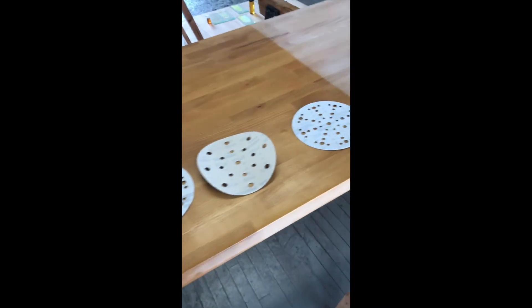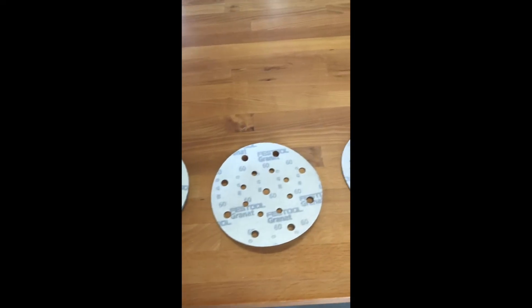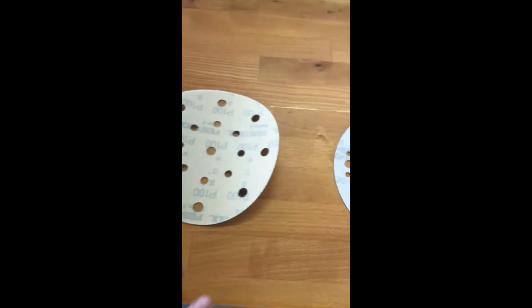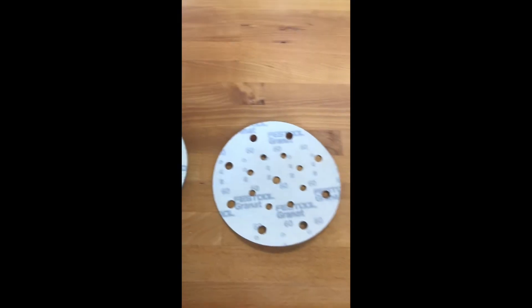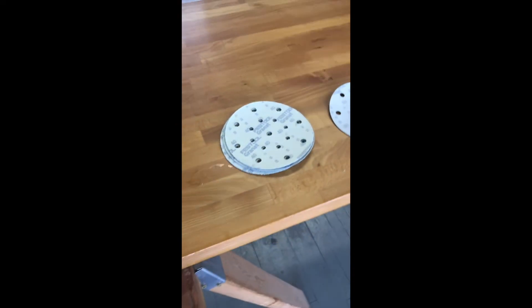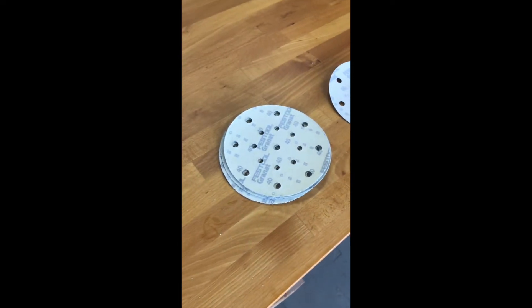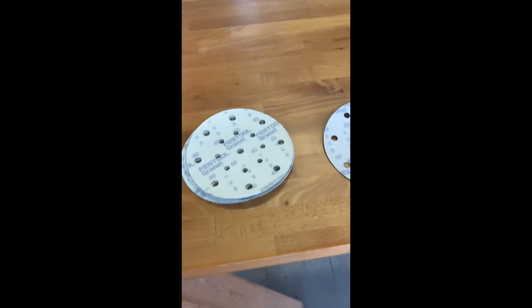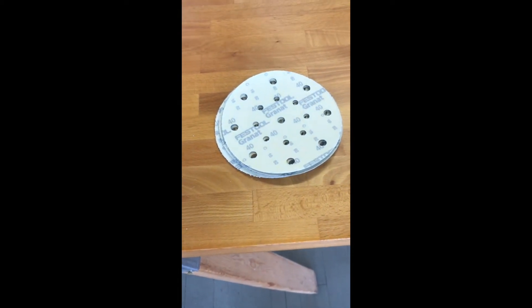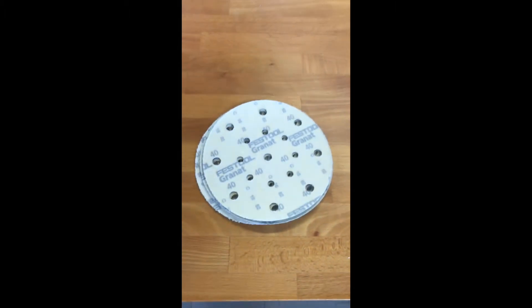The key to a good sanding is lots of different grits — successive grits of sandpaper — working your way from coarse to do the brunt of the work, and then basically polishing that up. Each step removes the scratches from the previous step until you make them small enough that the eye won't pick it up. I start with 40; you can even go lower. The lower the number, the coarser the paper — this is your best way to eat through as much wood as possible. When removing finish, we want to do it quick and coarse, stripping finish without creating a whole bunch of heat or spending too much time. So it's better to go coarse and quick and just get it off.